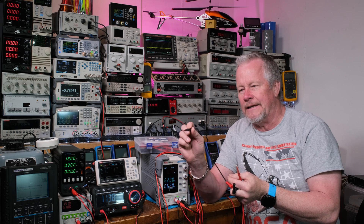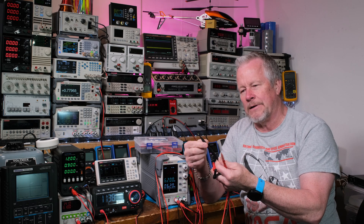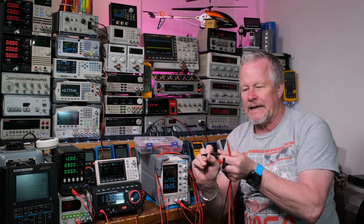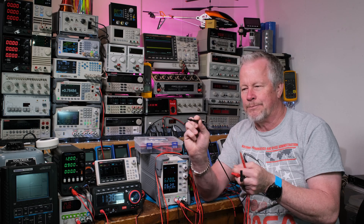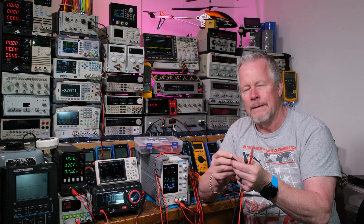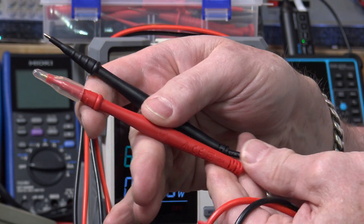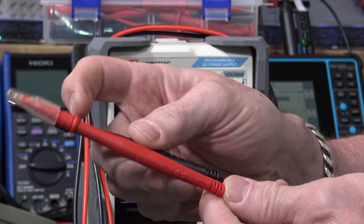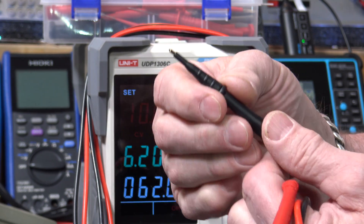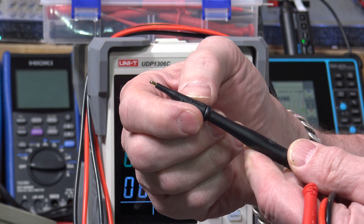They're nice and skinny — pencil-sized — so you can really see what you're probing. The neck is so narrow that it helps guide you, and it is soft back here. Here's a nice close-up: you can see how narrow they are, with a pretty small finger guard. The part that makes them category three or four is labeled right here on the tip and on the package.